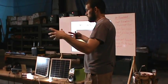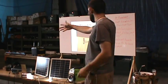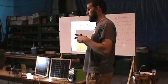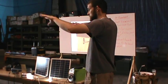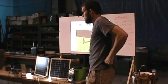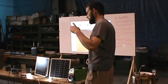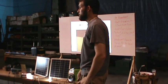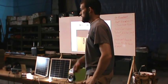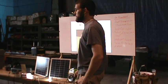Well, I work from one place out. Like with the wind turbine when we installed it on the farm, we worked from that spot, took it to a main power spot, and distributed it from there, and wired that to things from there. I wouldn't have a battery bank here and a battery bank there or anything like that. I'd take it all to one place and take it from there, because it's just so much easier to keep up with maintenance on it. Whenever you've got things distributed all over, that turns into a lot of work later down the road.